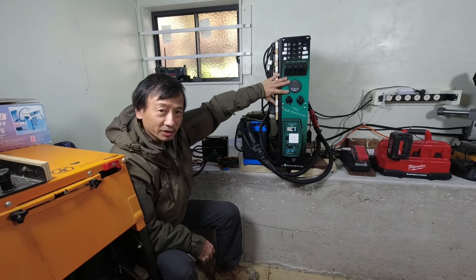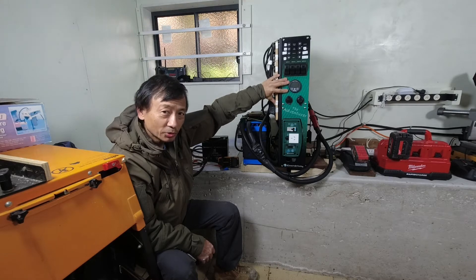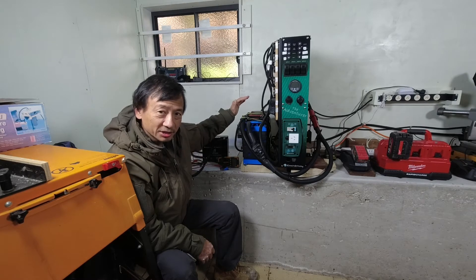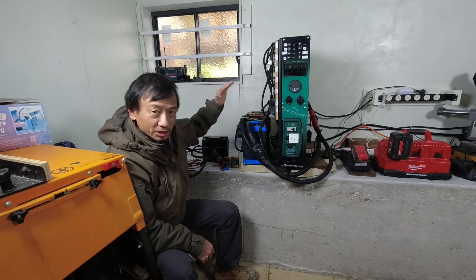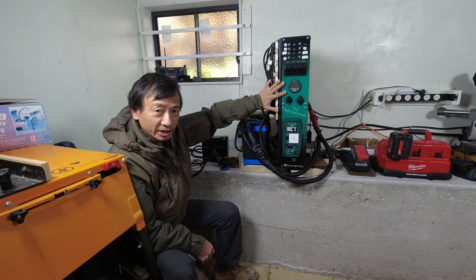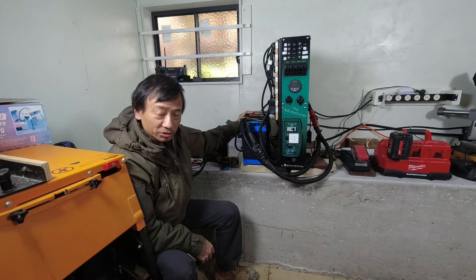The state of charge monitored through the ePro battery monitor is more accurate because it's based on actual values, compared to the factory setting state of charge in the battery management system. I'm doing this so that with actual values of state of charge, I can reset the tables in the battery management system from theoretical to actual values.